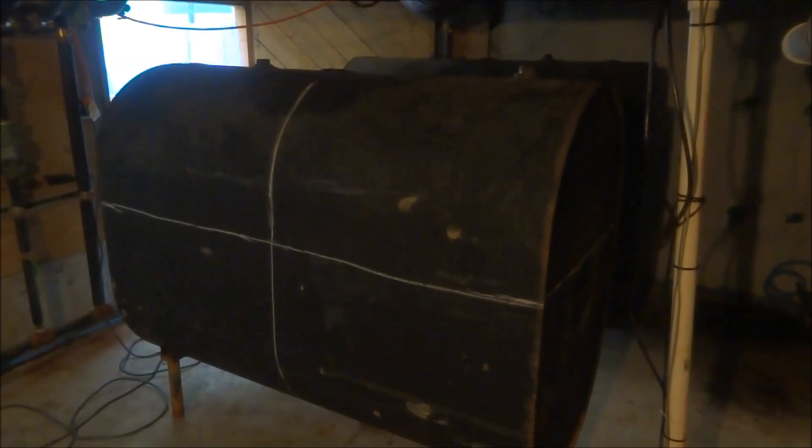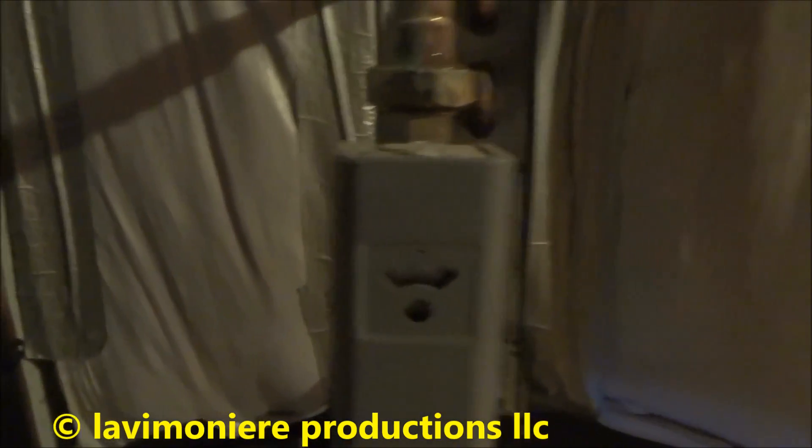They're going to get that temperature. That's just to turn the fan on, and then when it gets down like that, the boiler's going but I just get a little natural heat coming up with no fan. I took down and checked all the fans — no fan. 190 on the boiler and this stuff's not running, something's wrong. If I had to turn them, they were all at 180 — all of them. These young kids come and they think they know it all. They're just green. This one's at 170. Flipping kids.